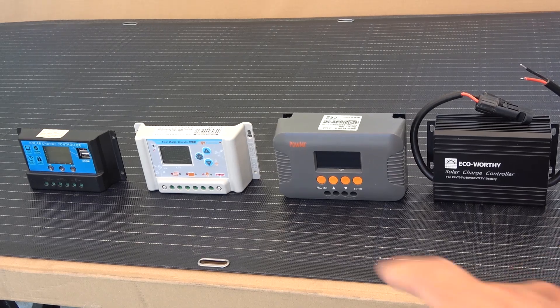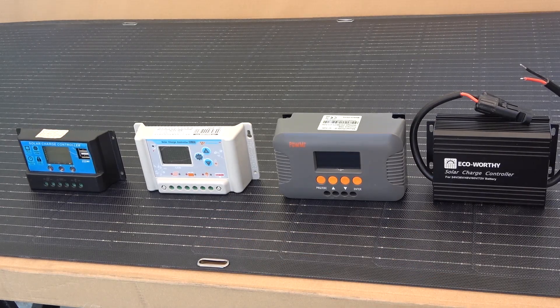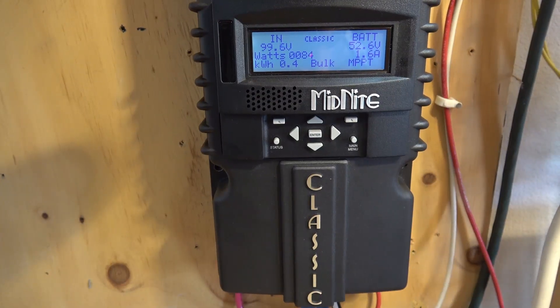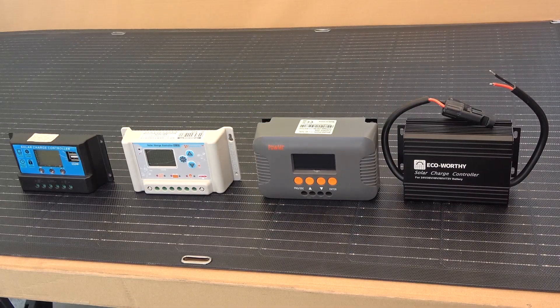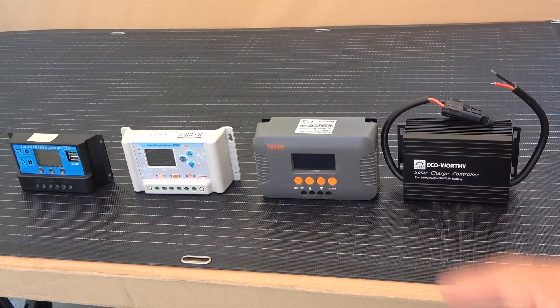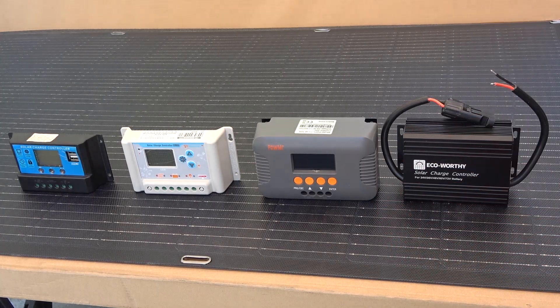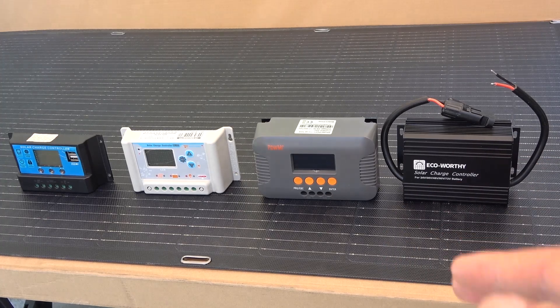If you have a 12-volt lead-acid battery, you need a special controller that can take the higher voltage and reduce it down to 12 volts — essentially a buck converter charge controller — or a more expensive MPPT charge controller. But if you want to charge a lithium-ion battery pack, especially for an electric bike with a 48-volt or higher battery, you can use a boost converter charge controller. This solar panel is best for that use case since it's small and light — perfect for an e-bike, RV, or golf cart, which typically use lithium-ion batteries.